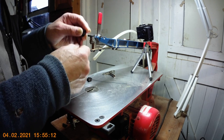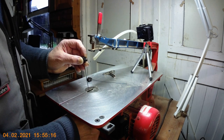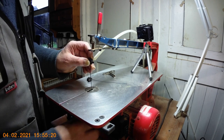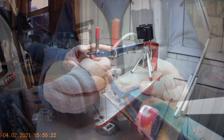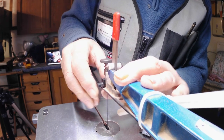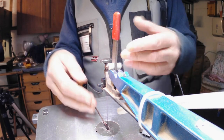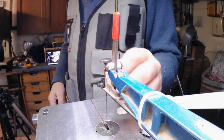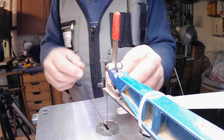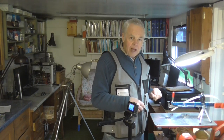Make sure the teeth are facing down, then simply put the blade through the slot in the table and hook it underneath — you can do it without even looking. Then this pops into the top blade holder. It's left slightly loose so that when you use the machine the knife edge can pivot and give you a more true vertical motion. That's how the machine normally comes.